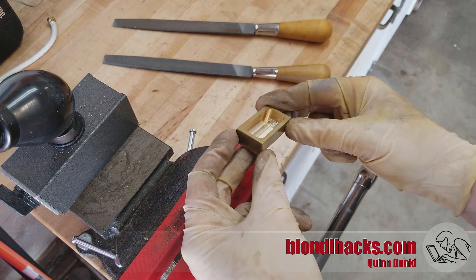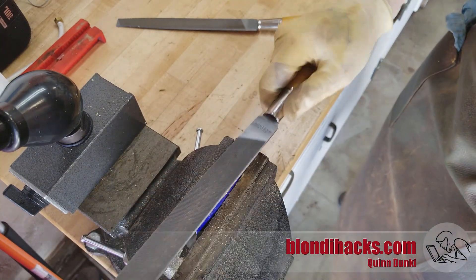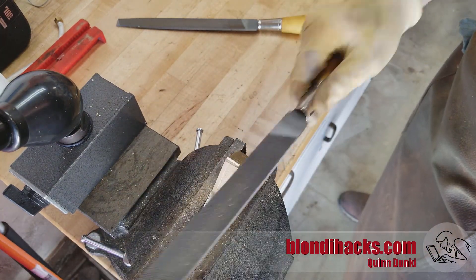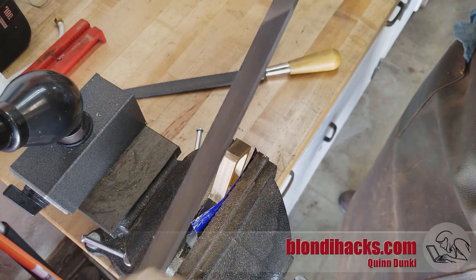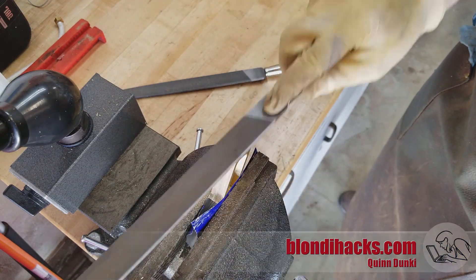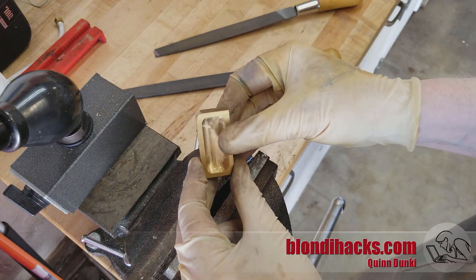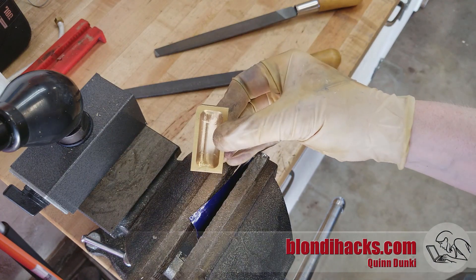Winding in carefully to get the final result, and then we just round those outside corners. We're going to do that the old-fashioned way, starting with a 10-inch double-cut bastard file. Notice the technique — I'm actually dropping the handle of the file on each stroke, and that's carving the opposite curve that I want the corner to have, which is counter-intuitive. It actually gives you a nicer result when filing corners. Finishing up with a 10-inch single-cut mill file, and just keep going until I match the radius on the inside corner, do the rest of the corners, and we are all done.